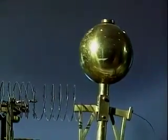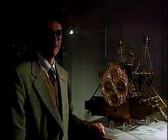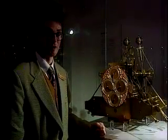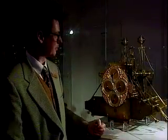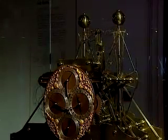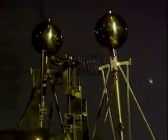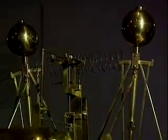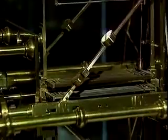In fact, an 18th century mechanical engineer invented an interesting arrangement of springs and weights to do that job. In 1730, when John Harrison was making his first marine timekeeper, the only really accurate clocks were pendulum controlled, because pendulums use gravity as a restoring force. But Harrison wanted a portable precision timekeeper, and so in his first machine, he designed, instead of pendulums, these two bar balances, which are interconnected at their centre. As a restoring force, he applied two pairs of helical balance springs — the upper pair which can be seen here. When Harrison was first bringing this clock to time, he would have adjusted the initial setup of these balance springs until it was close to timekeeping, and then for fine adjustment, he would have used these sliding weights to bring it to true time.